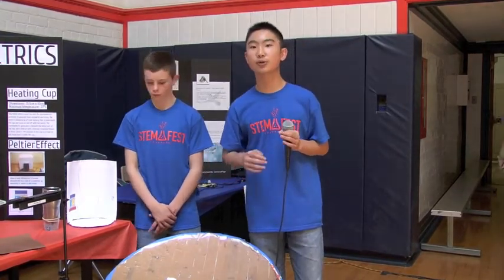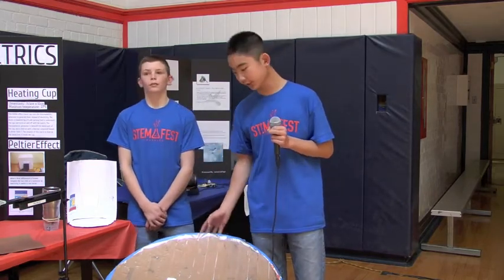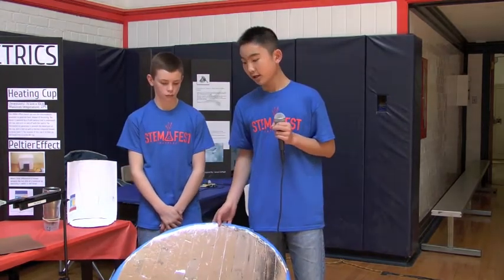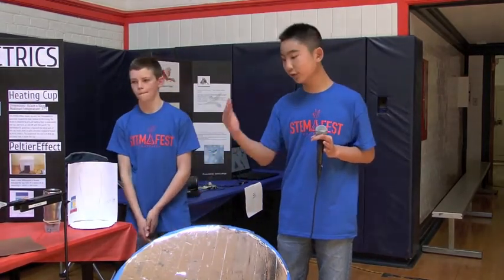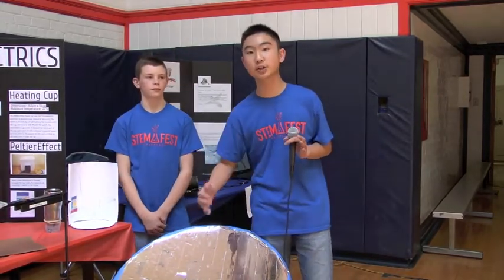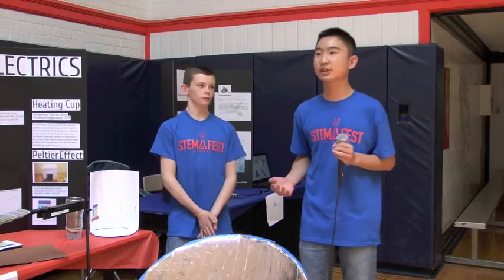However, pretty soon we learned that the thermoelectric generators actually require a lot of heat in order to function, about 300 degrees Celsius. So we attempted to achieve that level of heat using the parabolic solar reflector. Now, the interesting thing about the shape of the parabola is that wherever light hits, it's always reflected back to a single point called the focal point. And at that focal point, it can get really hot. In commercial appliances, these can reach up to 400 degrees Celsius, which can be used to fry and cook foods.